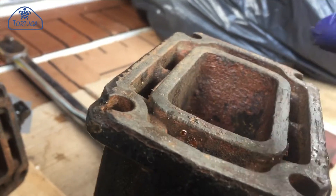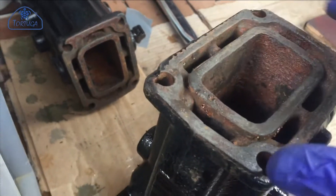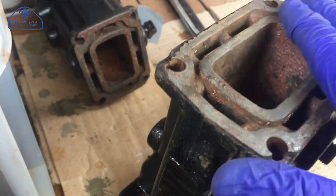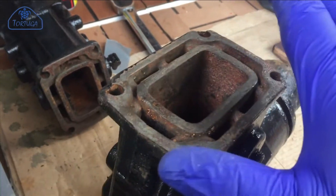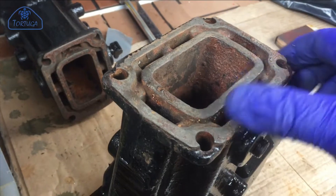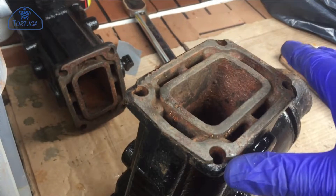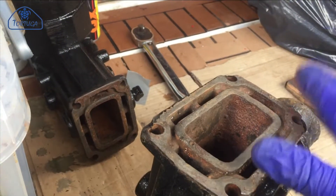I think the water has leaped in between the two. Also, being very honest, the gasket that was replaced last time was fitted using basically a Hylamar wipe sealant. And I've subsequently found out that that's actually the wrong thing to do — the gasket must be fitted dry. So I've probably contributed towards the failing in the first place. Entirely my fault.